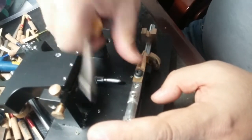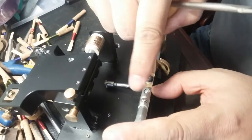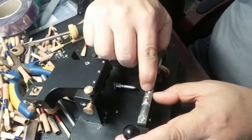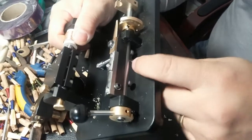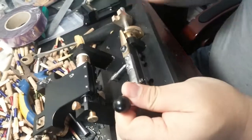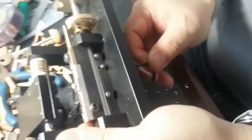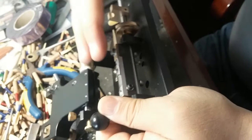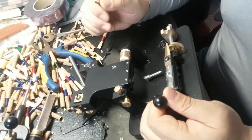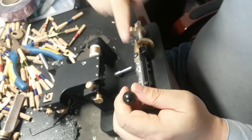If you lift up too much you can push it back. Or, if it's lifted only slightly too much and you cut slightly deeper of the U-shape, the other way to solve the problem is to release this back screw, then turn the screw underneath the middle screw a little bit in using an Allen key — turning it in a little bit to lift the back of the timber slightly up. That will solve the problem of cutting too deep. If you dig out the plug too much, then you have to push it back.